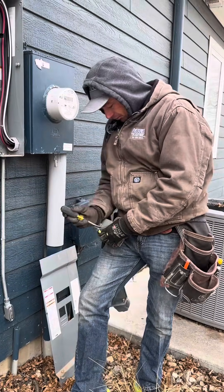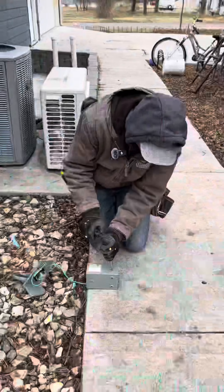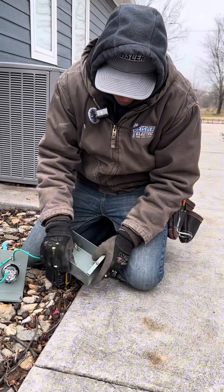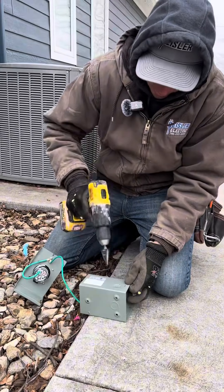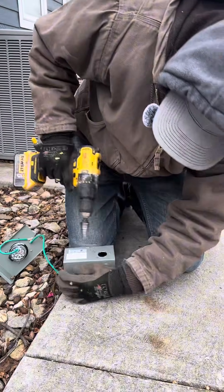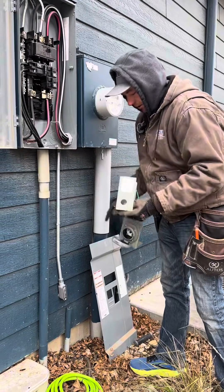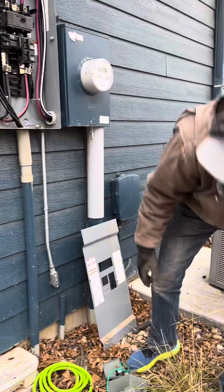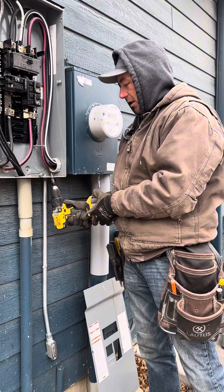That knockout won't come out — it's already bending and denting, making the paint break a little bit, so I'll just drill it out. Before I mount this I'm going to go ahead and bend this conduit. I already messed up at some point and drilled a half-inch hole here, so I'm just going to drill that out to three-quarter.